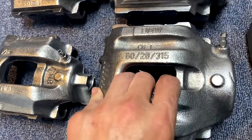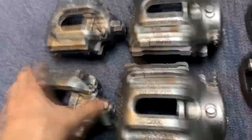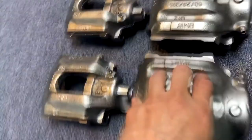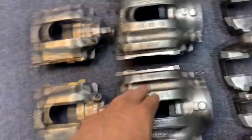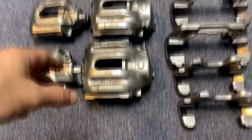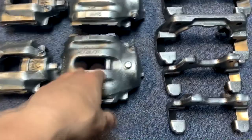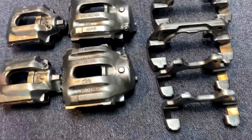Holding it with my hands and feet is how I got that cut on my ankle — wear and tear. I do have a small drill press and tried having the brush steady while moving the part, but that didn't work well either. The drill press was a little low on torque, so the high-RPM hand tool was the best option. One other thing: when you're done, get to painting right away. Carbon steel will start rusting overnight. It's always better to use mechanical means — sandblasting or wire brushing — to remove all rust and dirt.